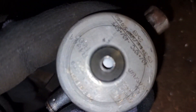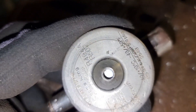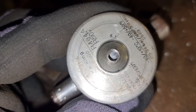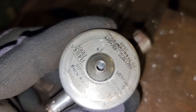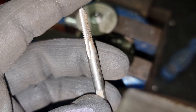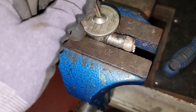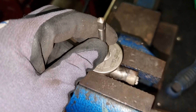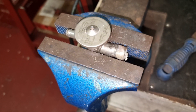That surface inside is the diaphragm, which is pushed by the pressure from the sensing valve we removed earlier to regulate the opening of this expansion valve. The next thing we need to do is create a thread in the hole we drilled, sized M4. Let's start making that thread.